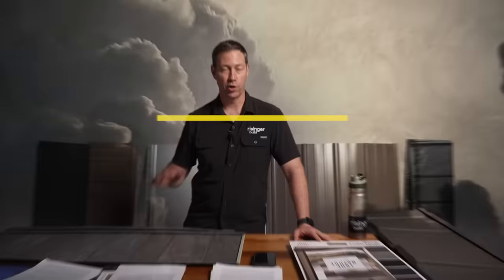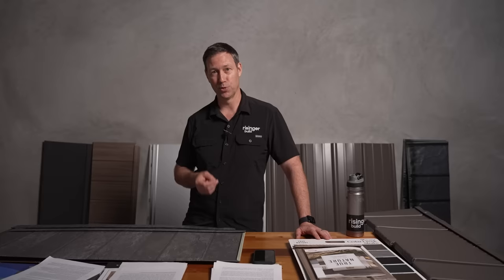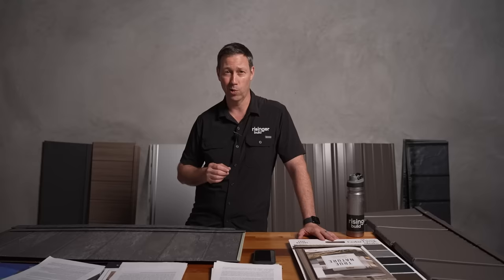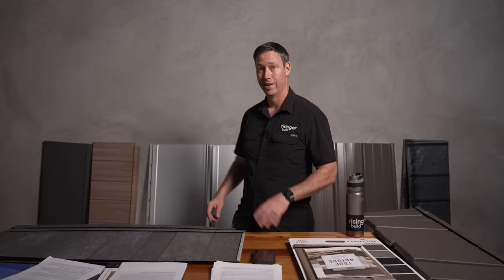Okay, myth number two, metal won't perform as well in extreme conditions. And this one I have some direct knowledge on. My very first house I built in Austin, Texas, as a custom builder under my own banner, I put a metal roof on, and only about a year later, that customer called me and said, hey Matt, you know that massive hailstorm we had that everyone's replacing their shingle roof in my neighborhood? You can't even see any damage on my roof. I put a 24-gauge standing seam metal roof, kind of like this one, on, and it had no issues whatsoever from hail that was somewhere between golf ball size and shy of a baseball size, just giant hail.